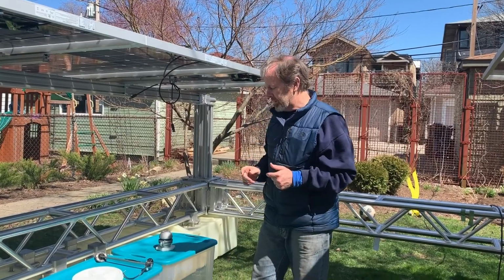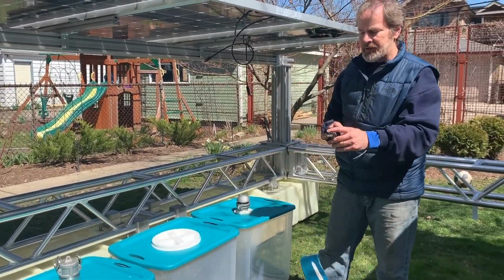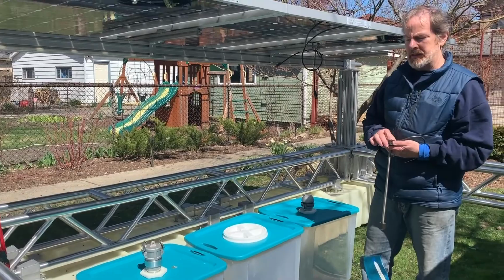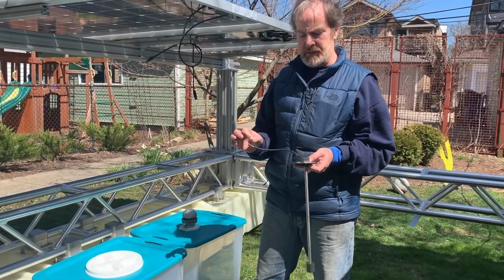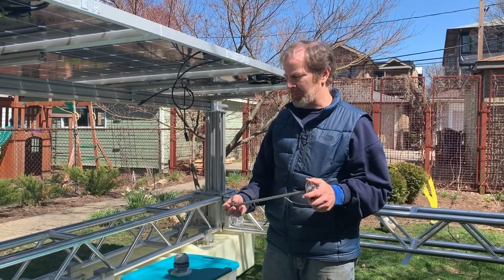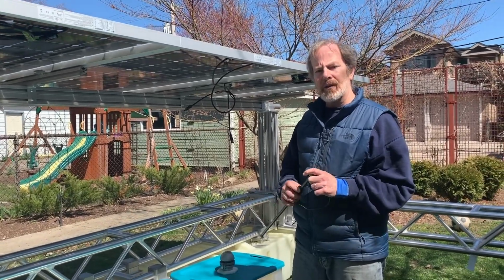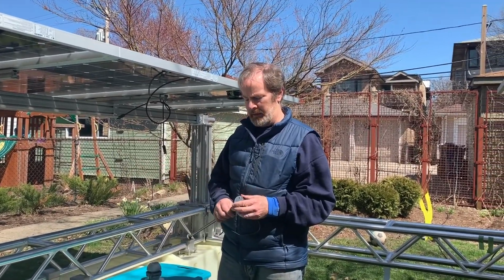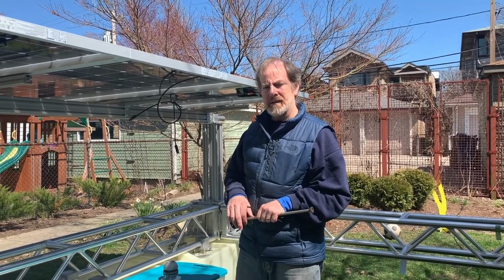So the other component that we're going to add with the tracker sled is this idea of monitoring the ballast. As I'd mentioned, these tanks are both 111 gallon tanks that are repurposed from the marine industry. Each of these tanks had a level indicator, right, that was connected to a communication system, so you can always tell the fuel level. In a similar fashion, we'll have to install something like this in each of the 5 ballast tanks that makes up the tracker sled, so we can monitor the level of the ballast. So if there's a problem, say a leak develops, we can immediately know about it and make a necessary repair. So in this case, the ballast will be part of that overall SCADA system.